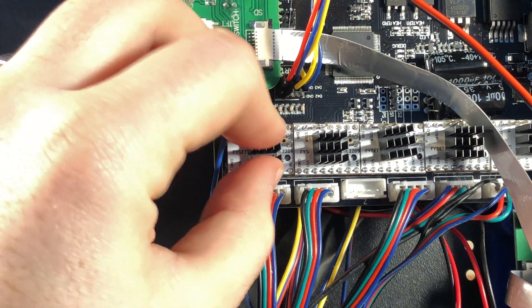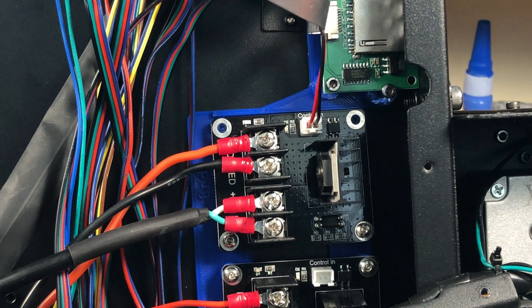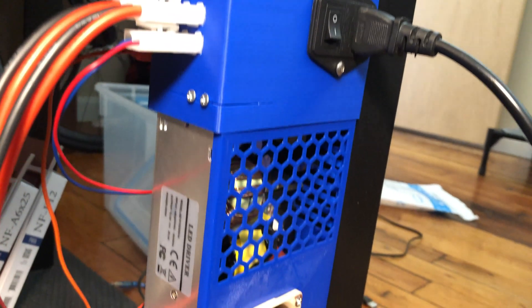With all of those upgrades complete, you should now have a much safer and quieter 3D printer. To recap: I replaced the stepper motor drivers with TMC2209s, which not only made the printer a lot quieter but also increased the microstep resolution by a factor of 16. I installed MOSFETs to power the hotbed and the hotend to reduce the amount of current flowing through the motherboard, which will prevent it from overheating. And I pulled the power supply out of the 3D printer and replaced the cooling fan, effectively extending the life of the power supply and making it a lot quieter. All of these upgrades were definitely not for the faint of heart, but in the end, I have a much safer and quieter 3D printer that I think was well worth the effort.